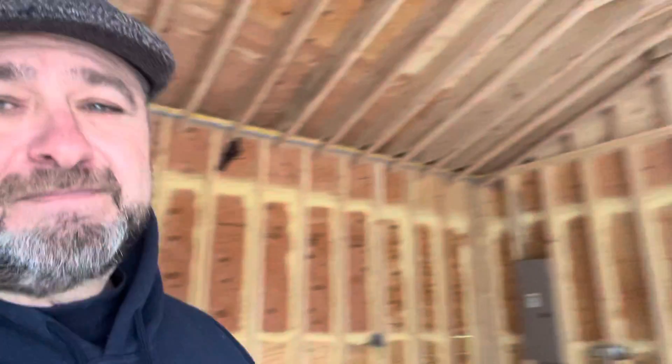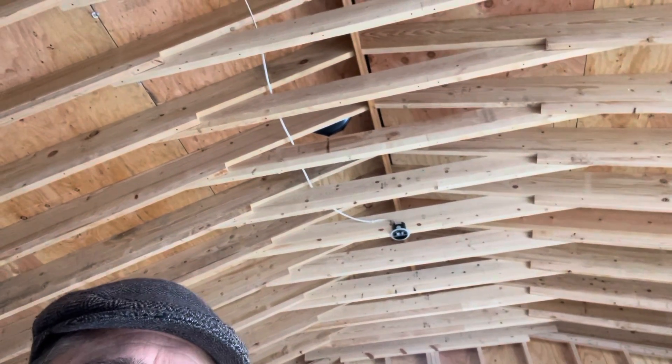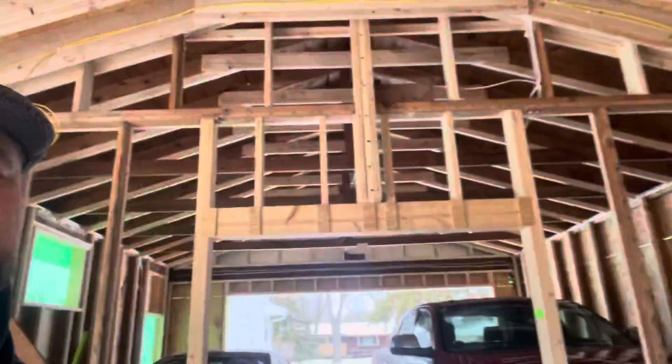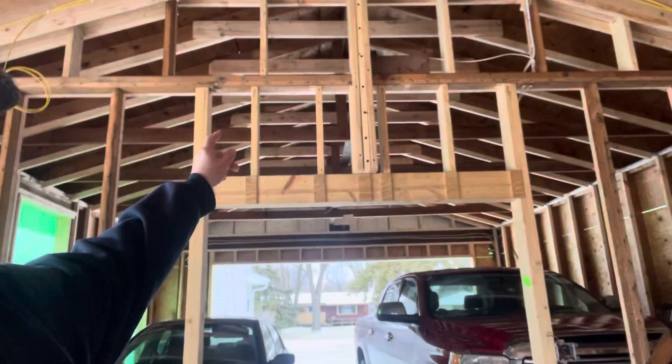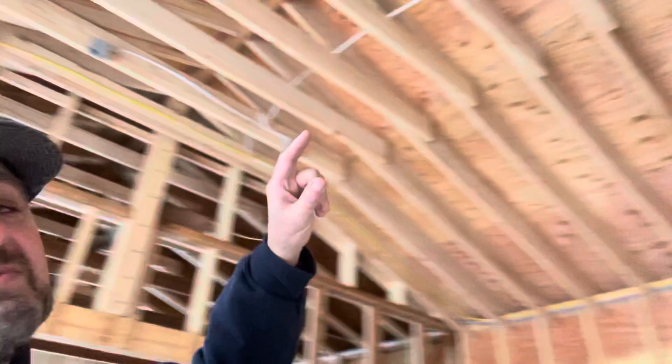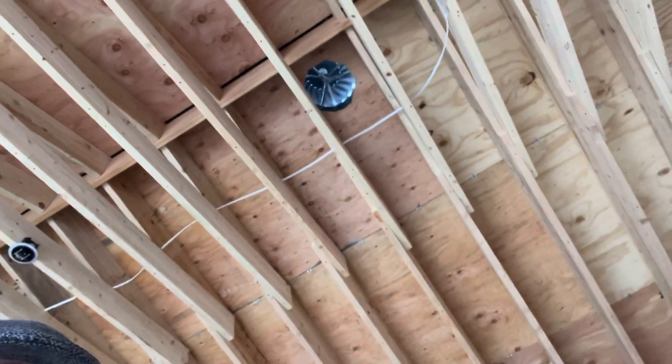One other key thing I want to convey is that by putting up the ceiling here with that little triangle, yes, we're getting the air coming in from the soffit in this area. But if you look around into the original garage, you'll see that that little triangle continues in there. So by having this one turbine vent, it's actually going to suck the air in from the other part of the garage as well, keeping the whole space nice and cool in the summertime, making it more comfortable, and also extending the life of the roof.